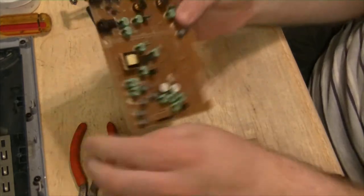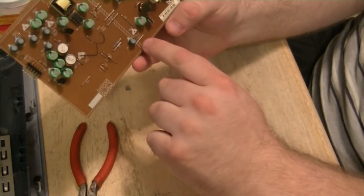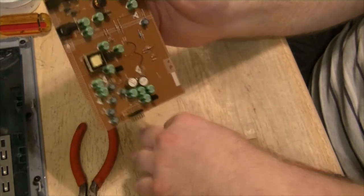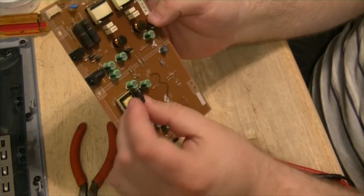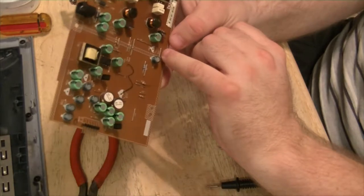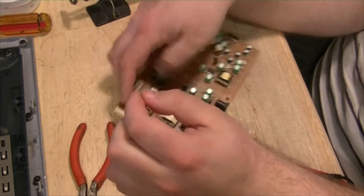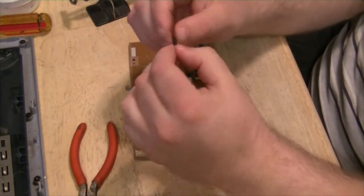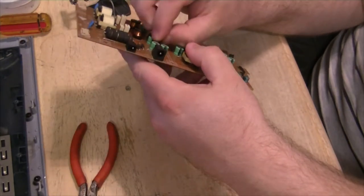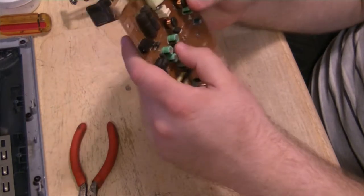Normally you have jumpers like, that's a jumper there. And there's another jumper there. There's one there next to that resistor. And there's a bunch of these in that CRT that are labeled as jumpers. Anything that's a jumper will have a J indication, like this is J16. That was J2. So I believe these to be fuses. So it'll either be enough of a fuse or it won't be. If it's not enough, it'll just pop it.